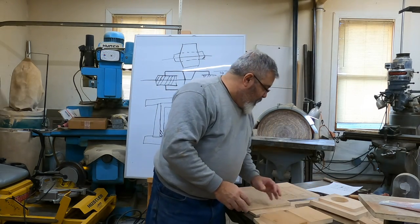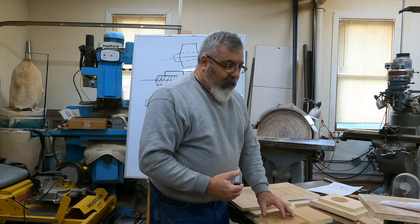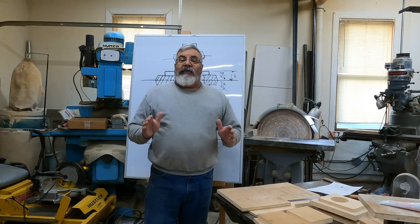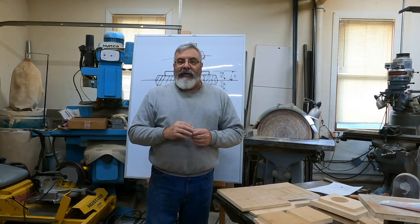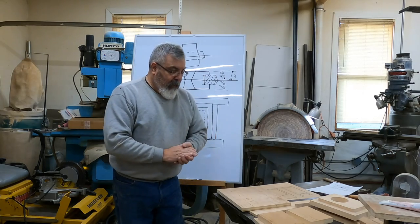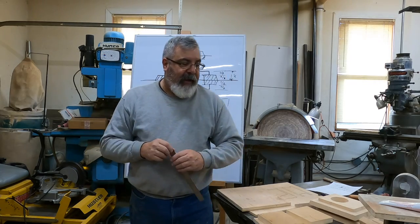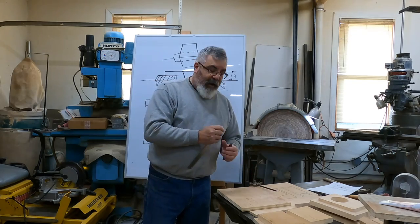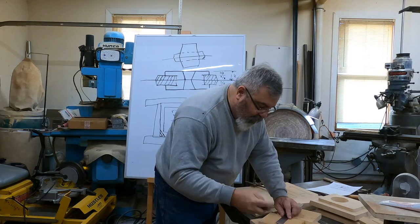So what we've got to do is, like I said, it's 4 inches plus we did an eighth of an inch draft. Then with these two, I'm going to add draft. It's going to make the hole bigger, make more metal go in there. So he's going to have a little bit more than an eighth of an inch to machine off, which isn't going to be a big deal. Actually, it'll be a little plus for him. So we're going to do it that way. On occasions, it does make a difference if you want to add draft or subtract draft. It's just what you're doing.